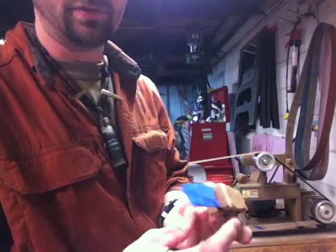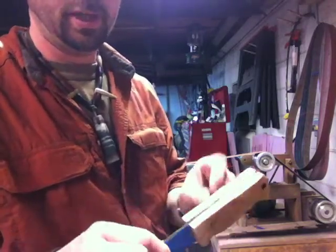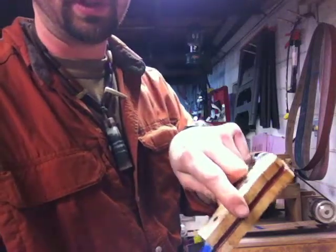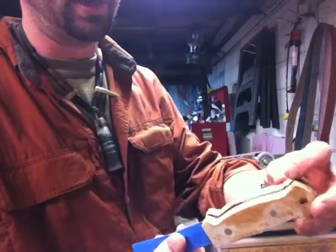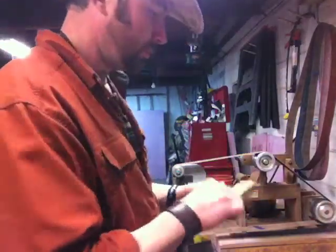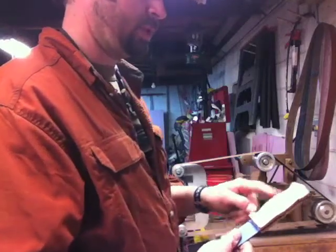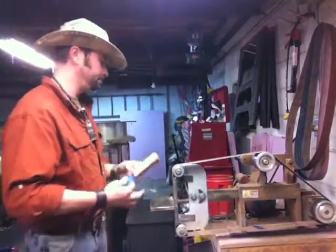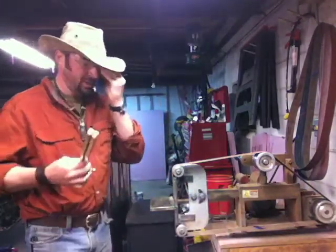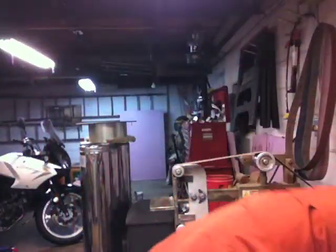As you can see, the front of the knife is finished, and that's all kept clean. The rest of the knife, the handles overlapped a little bit, and there's epoxy in there now. So what I'm going to do is lay it down on my grinder with it square, and shape the handles to the blade steel, and I'll show you a couple minutes of that, guys. I'm going to run my dust collector, so it's probably going to be more noisy than normal.